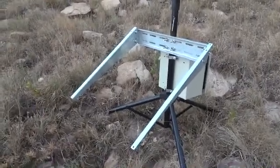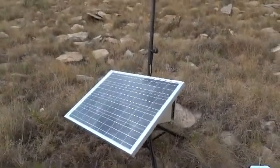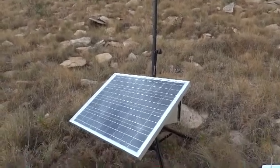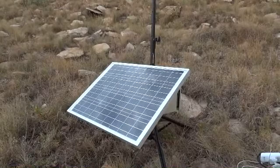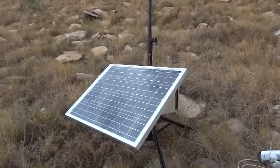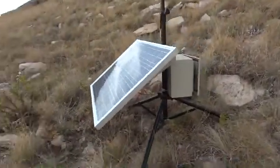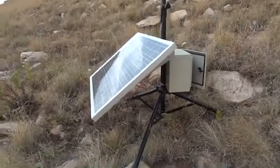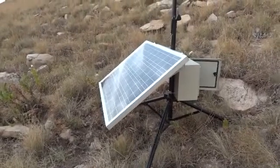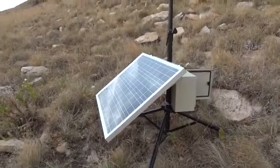It's getting a bit hair-raising because it is actually now beginning to rain. The solar panel is now attached and the wind here is blowing pretty ferociously. I just hope that the downward force exerted by the weight of the solar panel, the equipment box, and the big battery will be enough to keep this stand planted on the ground, because the solar panel acts as a nice wing or sail in the wind and the whole lot wants to go flying off.